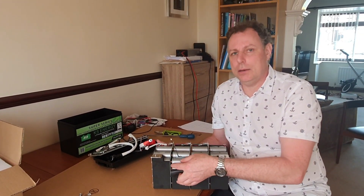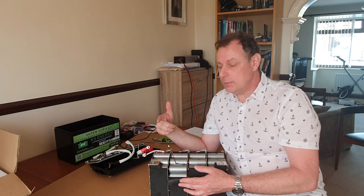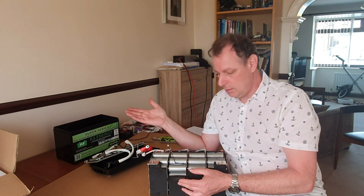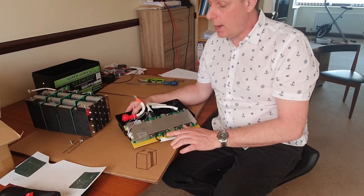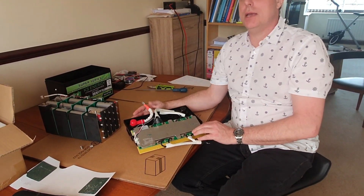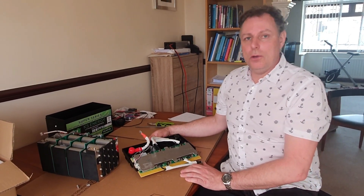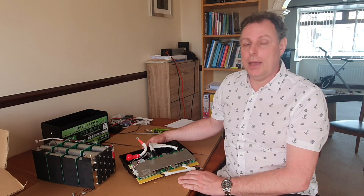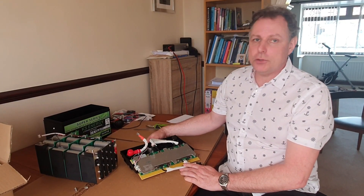Cylindrical cells are mechanically more stable because of their inherent design, so we do prefer these in our super serious premium batteries. There's one more thing I wanted to mention on the BMS: low temperature charge protection. This monitors the cell temperature, and if it's below freezing the BMS will not allow any charge at all, because attempting to charge any lithium cell, regardless of what chemistry it is, below zero can cause permanent catastrophic damage. I hope you enjoy the view of the battery — thanks for watching.